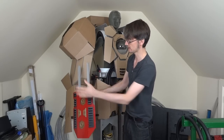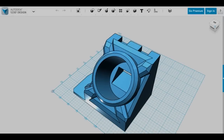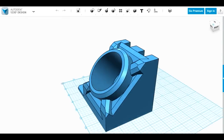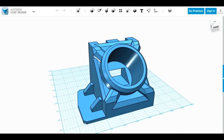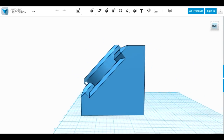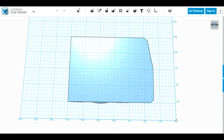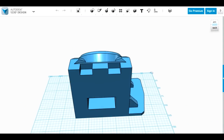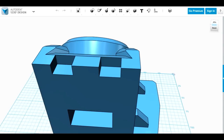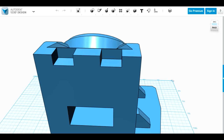And then think a bit about the rest of the back of the hand plate and the elbow hinge. I need a couple of extra bits for the hand. One of those is some sort of repulsor setup, so I've designed this part to go in the palm of each hand. These are roughly cut out of 100mm square blocks, so they're fairly sizeable. That'll stick flat onto the hand plate onto the palm. I've left these cut-outs at the top in that corner so that I can attach a piece to the bottom of the forearm there as a bit of a cross brace, which will be easier to see once I show you the physical parts.